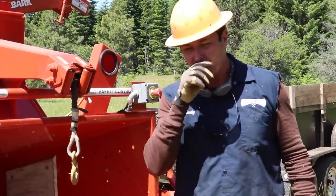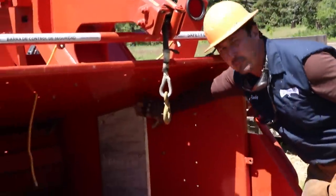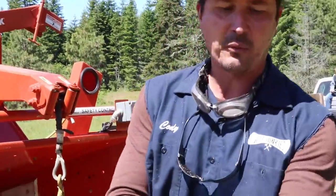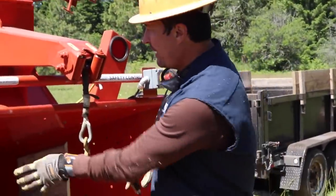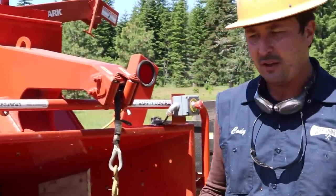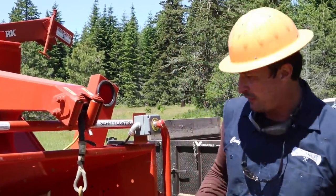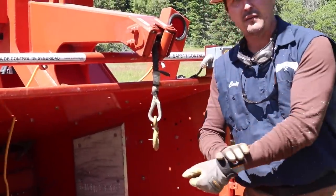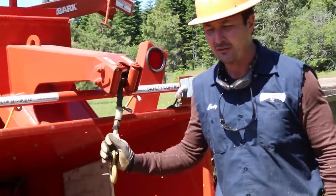Safety is a huge concern. Every year you hear about tree workers getting pulled into these things, and the thought of that is just terrifying. But if you look at these aluminum pads right here, those are sensors. Those sensors are tied into a wristband that we're all wearing. It has a chip in it. If this wristband comes into contact with that sensor field, it will shut everything down. So if you accidentally got caught feeding a tree in, as soon as that device touches that field, it'll shut the whole thing down. It's kind of like the SawStop technology on skill saws.